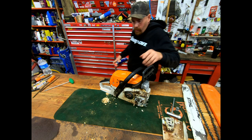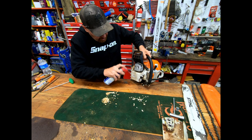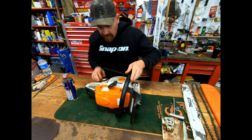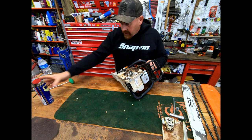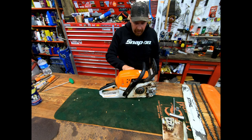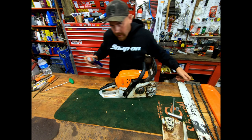When I want to actually clean a saw up, I use WD-40 because it seems to eat all the sap and crud. Drop a comment if you have a better idea. The sap sticks really bad, and WD-40 is really more of a cleaner than an oil — people think it's oil but it's more of a solvent. I spray everything down and blow it off with compressed air and it cleans up good.